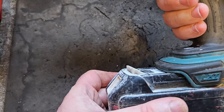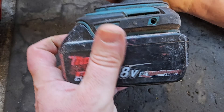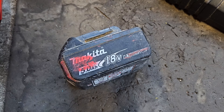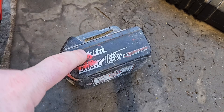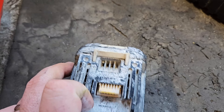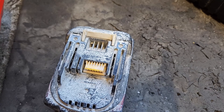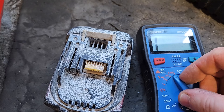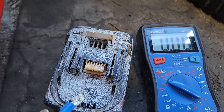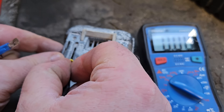Which is no surprise, and this one is faulty. What I'm going to show you in this video is how to test this battery to show you what the fault is. The first test you can carry out is an overall voltage test. Use a multimeter for that, and you just test the power coming out the top.